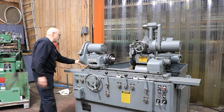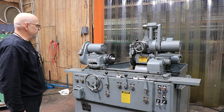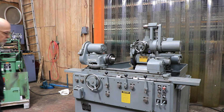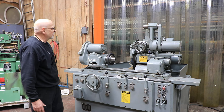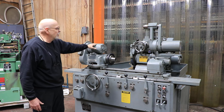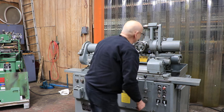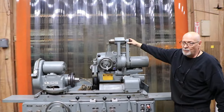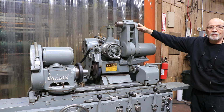This has a cooling system on the side — a tank with a pump. Turn the spark-out timer back on and it kicks out. So that's the Landis 1R — it's a nice machine, original paint from the factory. These machines are built very well, very heavy duty. Of course, you could swivel the table by loosening the two ends and using an Allen wrench. You can spin the wheel head and also rotate the work head. You have your fold-down ID attachment. The guard is rubbing here, but it is a very high frequency — it's a 40,000 RPM spindle. There you have it — this is the Landis 1R cylindrical grinder.